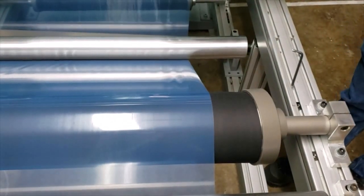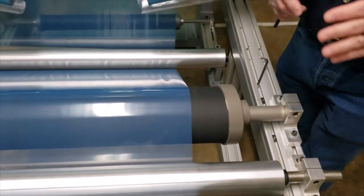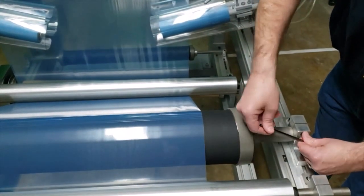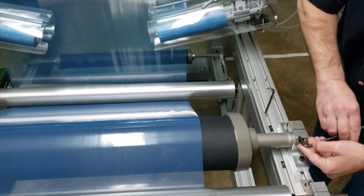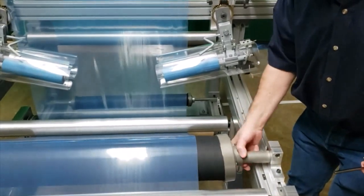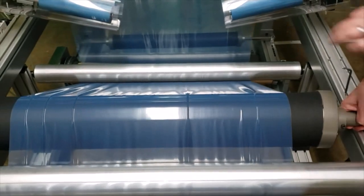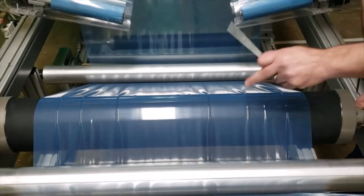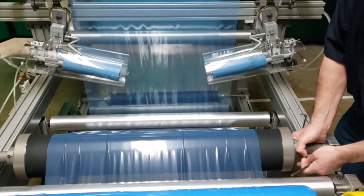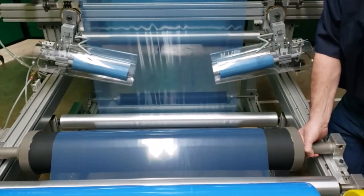Just to prove the concept of the roll, I'm going to show you what happens if this roll is turned backwards — oriented improperly. I'm going to loosen up this mounting block. When I rotate this roll now, you're going to see a whole lot of wrinkles come in. I'm entering on the expanded portion of the roll and exiting on the contracted side, so the roll is putting wrinkles in. If you want to see those wrinkles removed, all I have to do is orient this roll back to the proper position — and now you see all those wrinkles removed.